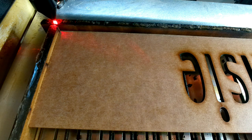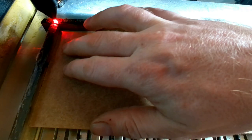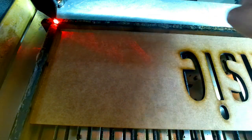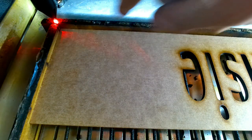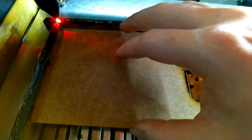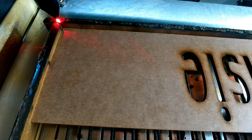So what I'm going to do is try to engrave on this left side using the default settings. This is at zero, zero. That's where these two bits of wood — they're just stuck down with some double-sided tape — are at zero, zero on my machine. And I'm going to show you what happens when you try to engrave close to this edge and what the machine does.